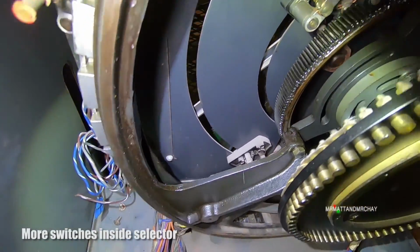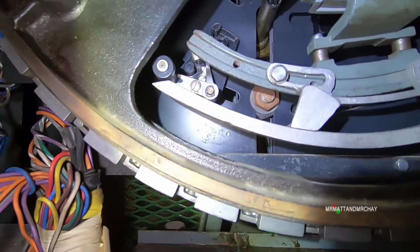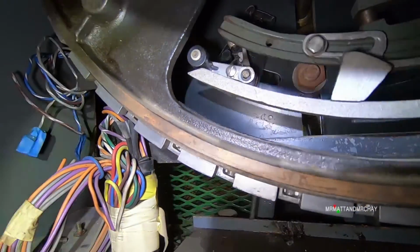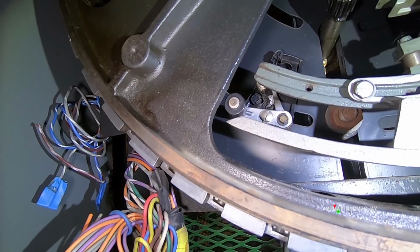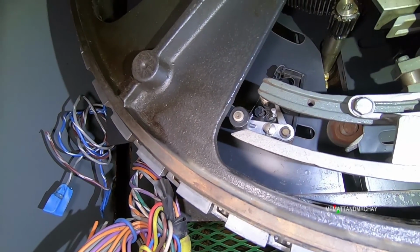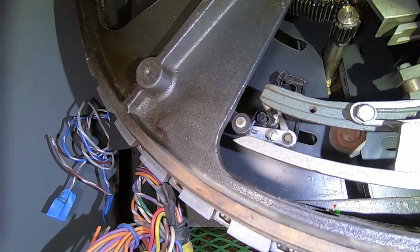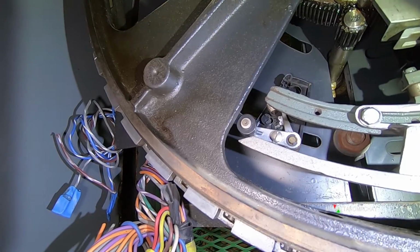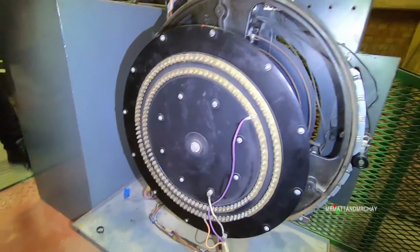Now the additional roller switches in the middle of the Schindler floor selector wheel. This inner set are probably over travel switches. The lift only stops at two levels, so it's not possible for the selector to reach this switch unless the lift over travels. This would be a backup to the roller switches placed at the top and the bottom of the shaft, which also shut down the lift in the event that the lift goes too high or low.